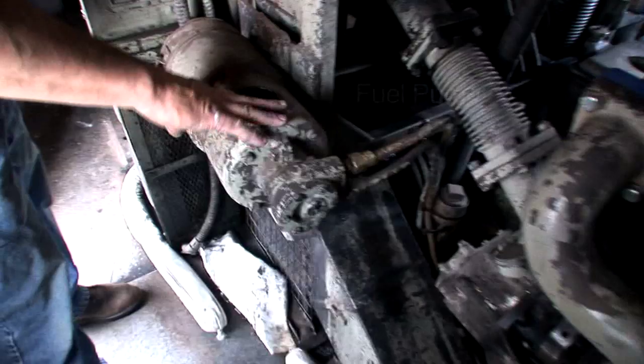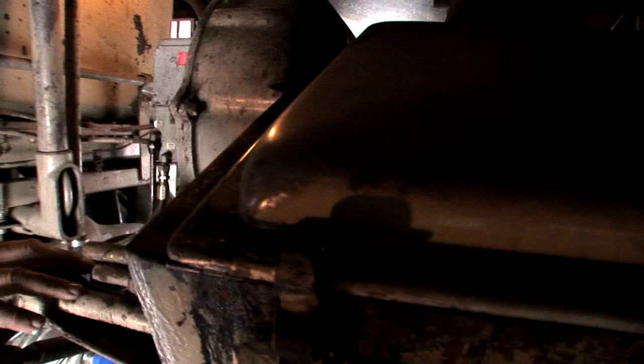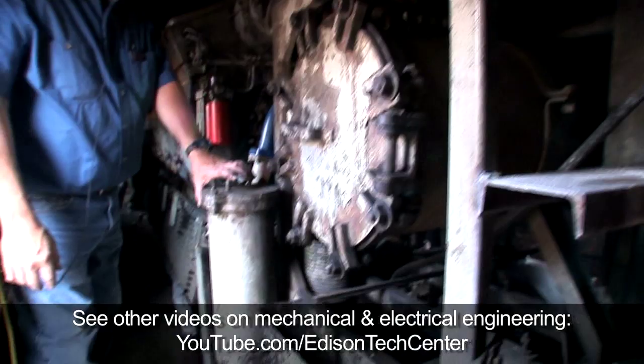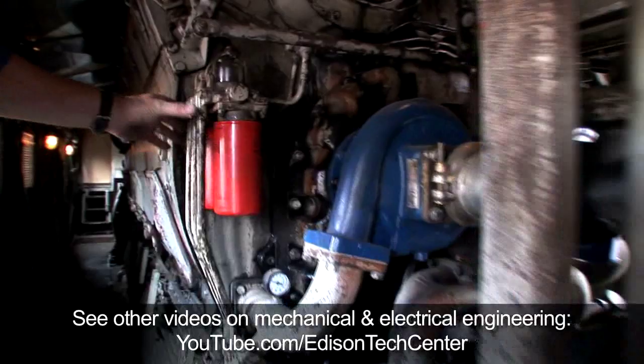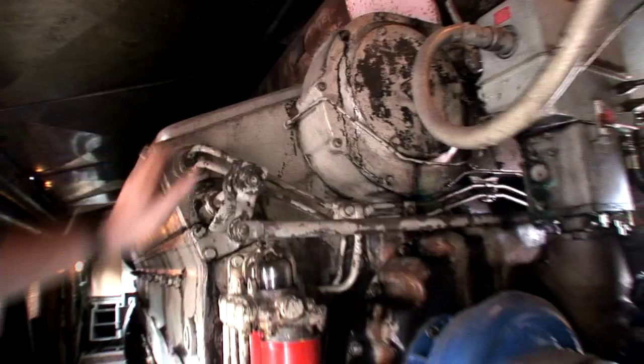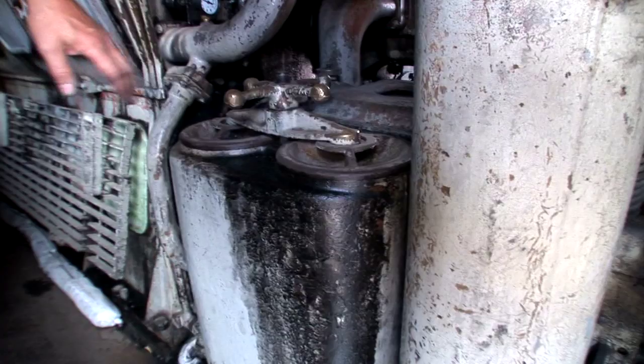This is a fuel pump. It pumps the fuel to the fuel rack, which is inside the valve covers. These are the oil filters — there are four main oil filters in here, changed every 92-day inspection. Here is the main fuel filter, and these are the final fuel filters — there are two of them. If one plugs, you have a secondary. These are the sight glasses; when you go to start the engine, these have to be full of fuel so you know the fuel rack is full. This is a strainer for the oil system — it strains the oil as it's coming back before it goes through the filters.